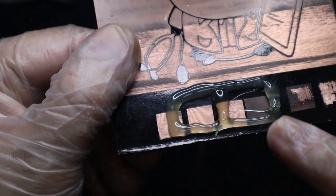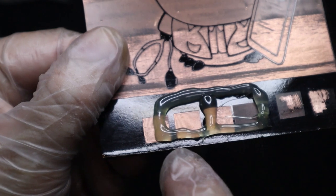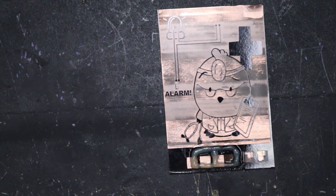I've made a little moat out of hot glue, split it down the center, and I'm going to put isopropyl alcohol in one side and acetone in the other — we'll see which one removes the paint the quickest. We'll give it about 10 minutes and then rub it off and see which one works easiest.